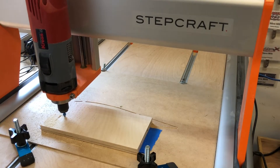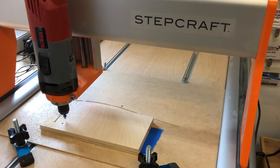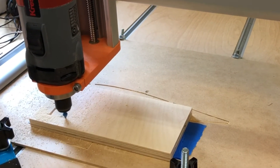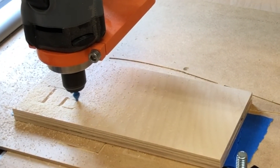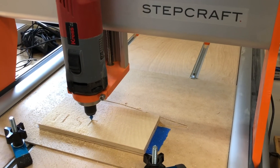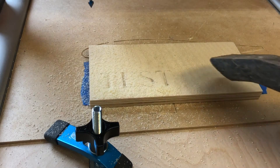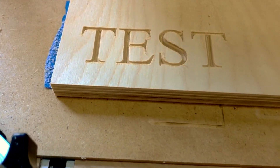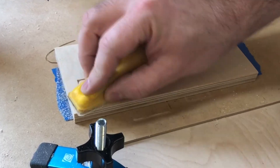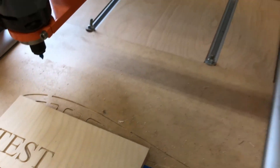Since this is the first time I've run these bits, I probably went a little conservative on my speed rates and especially my plunge rates, but we'll speed this up and let you watch the cut. It turned out fairly clean but there's a little bit of fuzz on the top, so let's go ahead and take some sandpaper and just clean that up. With that it's all cleaned up, looking pretty good for a free bit — thanks for watching, we'll catch you next time.